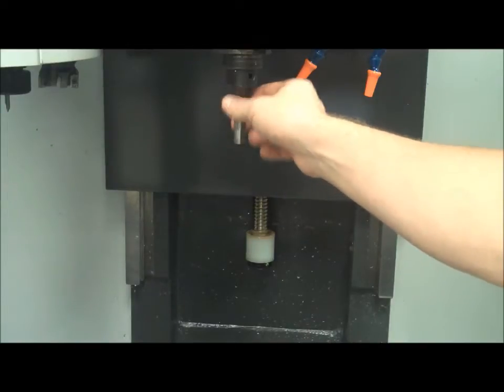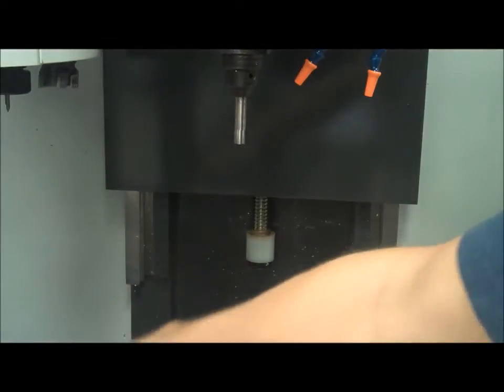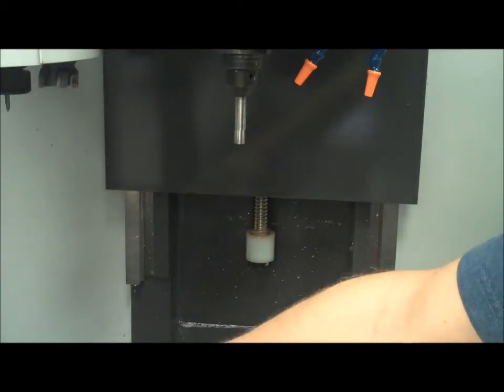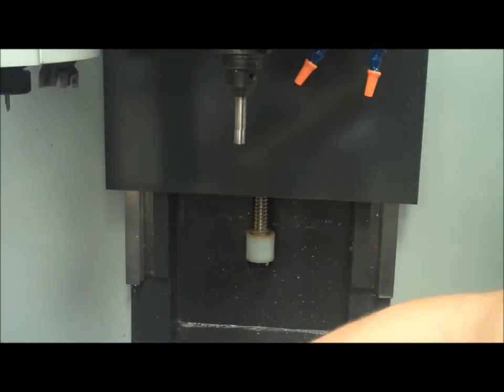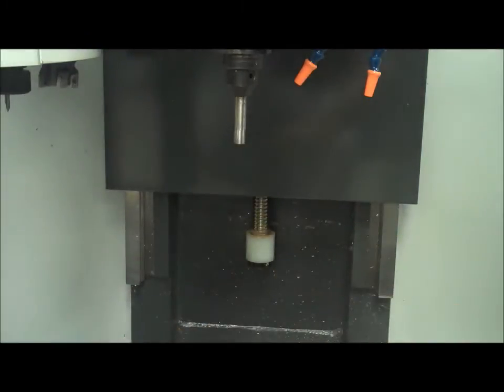Now we're going to use this in the exact same way as you may remember. We're going to go ahead and touch it off on one side and then on one edge to find our origin. Now in our case, for most of our projects, our origin is coming from the top left corner, and so we're going to actually position this edge finder down at the top left corner of my part. So the first thing I have to do is start up the edge finder.